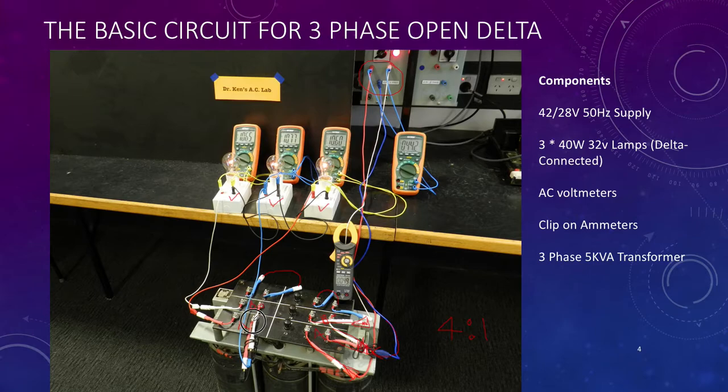On the output side, I've taken the starts of each of the windings and connected them together. I've taken the blue out to supply the load, connected the red to go to the red load, and the white to go to the white side of the load — so our A, B and C — effectively excluding the red winding part. The transformer is a three-phase transformer, so we've got one, two, three windings. On each of those windings there's an internal part which is the secondary and an external part which is the primary — effectively six coils of wire in three sections.